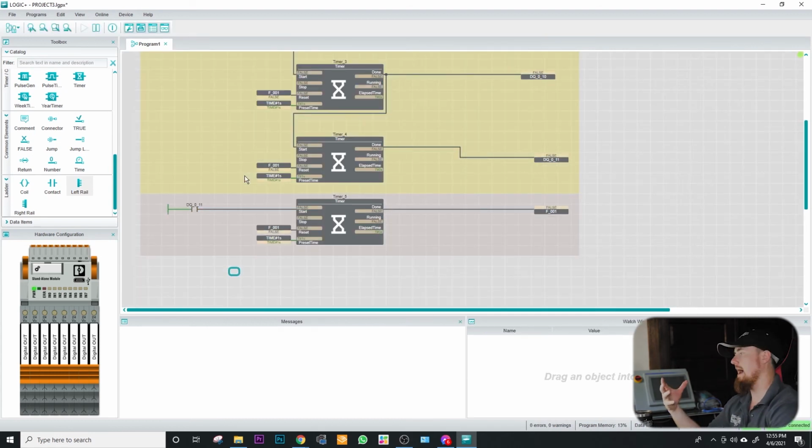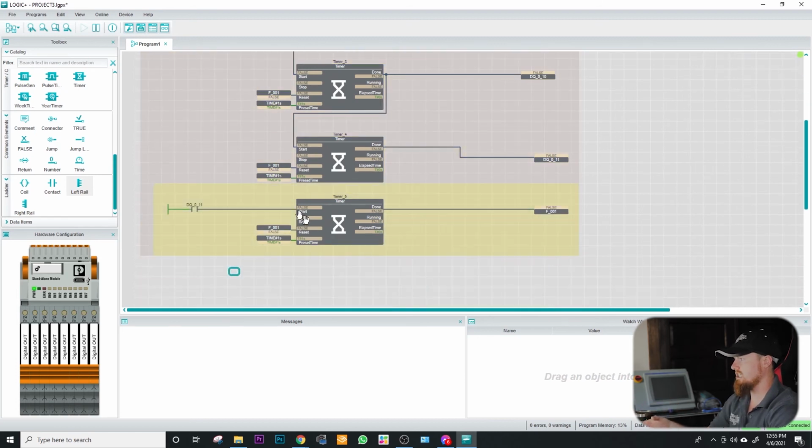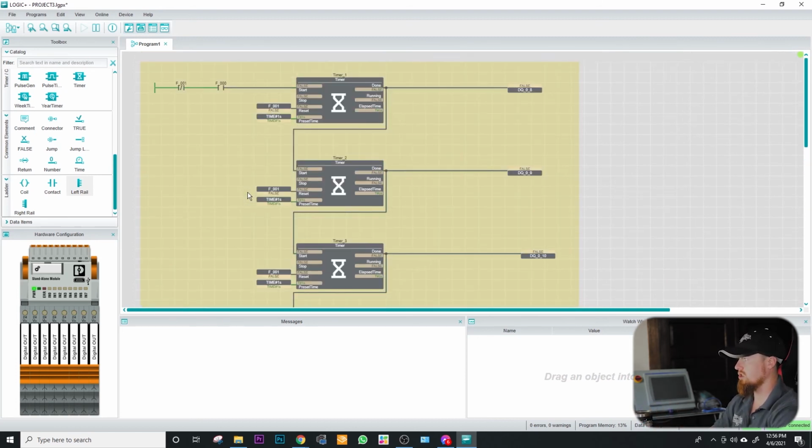And so these are really good practices. If you want to see how a scan sequence works, don't spend a ton of time researching the scan sequence of something. Just test things. Just plug this in and see how it works. If you just pay attention to how the PLC code is executing, then it will show the way the scan sequence is actually operating. You just have to be methodical and think about how things are executing and what's executing before another thing. And you may have to play around putting timers with one-shots on stuff to make sure that it's executing the way that you think it is.